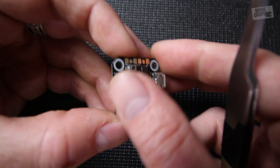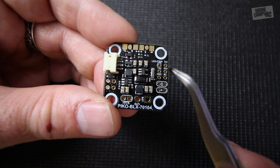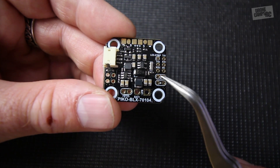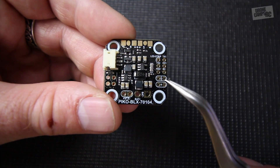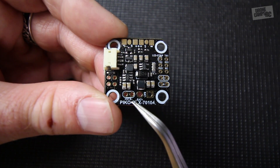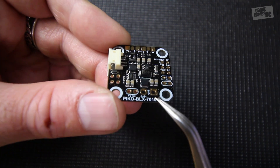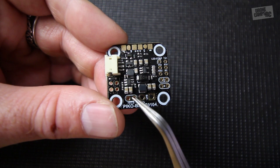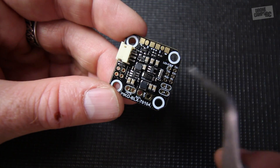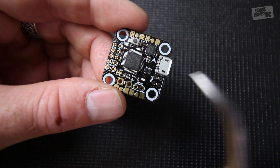Flipping it over to the bottom: at the very top we have LED strip support, then TX1, TX2, RX1, RX2, and an RC pad. Below that we have two options for 5V out if you need to run 5 volts anywhere on your quad — positive and negative. At the very bottom are two terminals for your battery: the round one is positive and the square one is negative. Over to the left there's a VTX hookup — positive and negative running out to your all-in-one camera/VTX setup. You can also add a buzzer with its positive and negative pads right there.